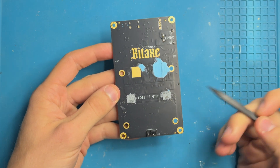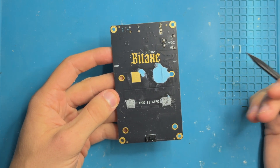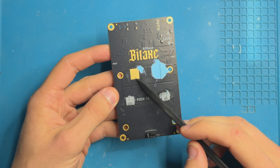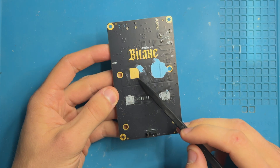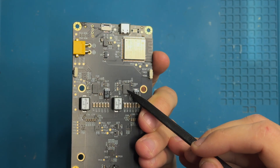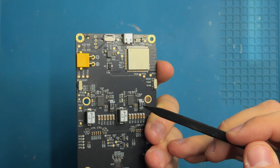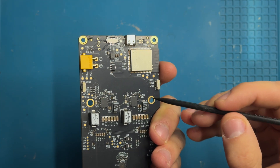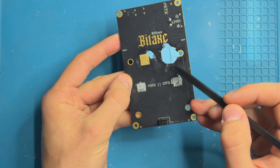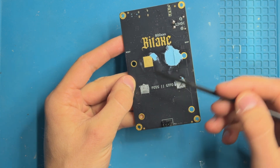We have both of these chips — the heart of this device. There are plenty of changes on the back. One of the nicest things on the front are those gold-ish plates. These are basically plates that go through the PCB into these tiny devices, which are the TPS546. These are the buck converters that convert the incoming voltage down to the voltage that the ASIC actually needs. This right here is a place where you can attach some thermal compound or blue goop.